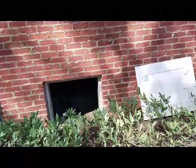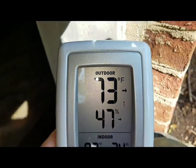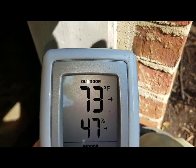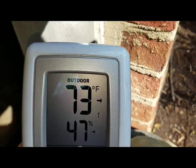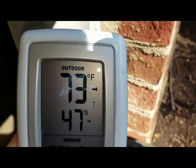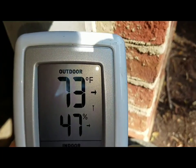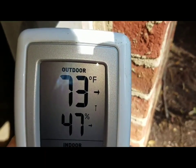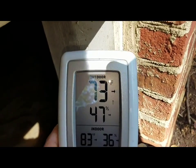The final thing I need to show you is I installed a monitor system under here — just did it recently. The only thing you're really concerned about are those top two numbers and that bottom moisture percentage. Right now it says 47% — that's inside the center of your crawl space. You always want that moisture number to stay below 50%. If it reaches above 50% you have a problem and it is creating more problems, so pay attention to that number. If it gets above 50%, call me — you need your encapsulation. Thank you for letting us do the work, I really appreciate you.